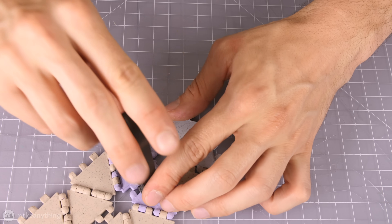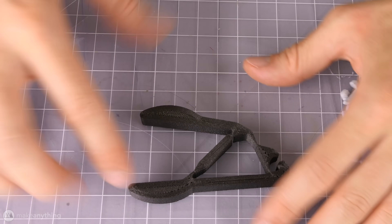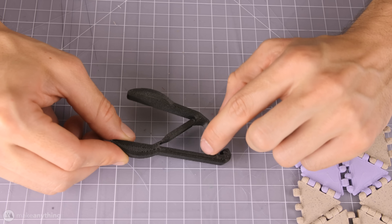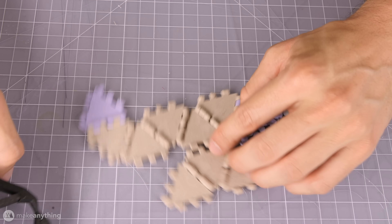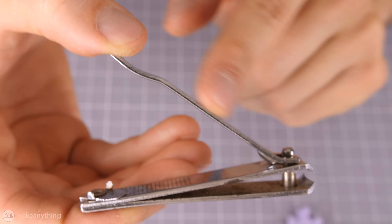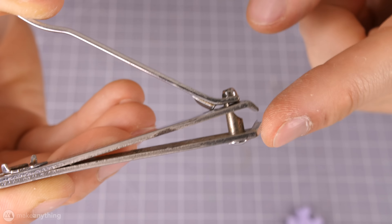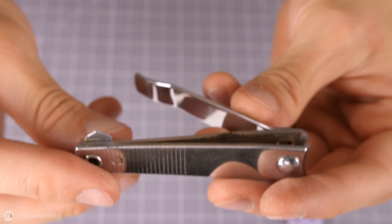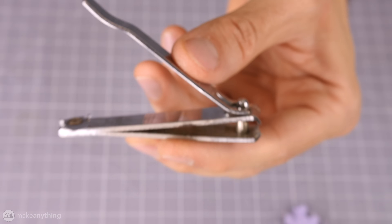I thought, why not create a compliant mechanism that I can use to help connect these panels. These pliers are cool because they're designed as basically just a shape that can be cut out of a flat sheet of material — you could laser cut a sheet of acrylic and create these pliers. But I'm 3D printing, and with 3D printing you can create more complex mechanisms. Nail clippers are great because they've got a lot of leverage going for them. They've got a pivot all the way at the front, which means that this long handle, when you press it down quite easily, creates a very small but strong force here at the front — strong enough to clip your nails. So I thought I would try to basically replicate this mechanism in order to connect poly panels, doing it as a compliant mechanism.